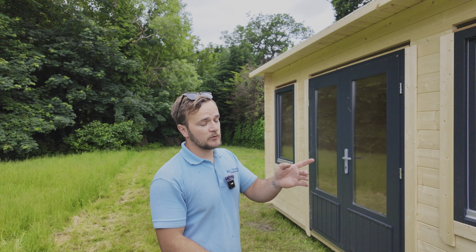I have already done one, so I end up looking like I know what I'm talking about. Hopefully I do. Cladding boards, 11mm. If you saw the roof joist down there, there's cubes that have been fixed to the side. What they are for is we want to fix our cladding underneath to those, trim it off internally, and our insulation goes above with an air gap.